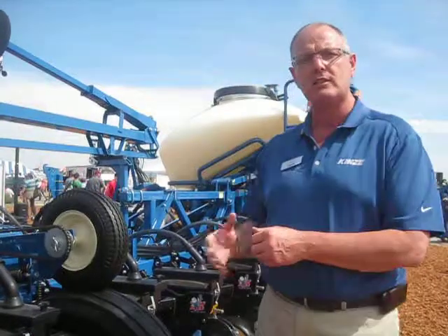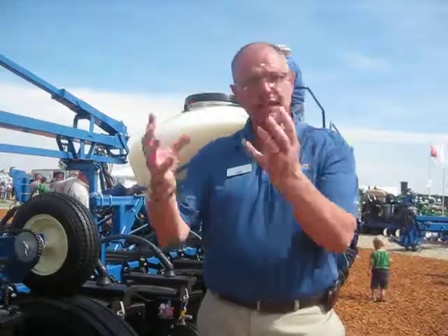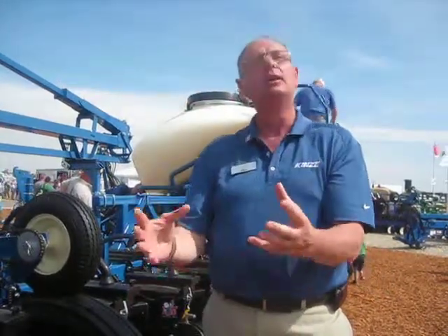What it does is, as you can imagine, you have these bulk tanks that you see behind me that will contain a total of, in this case, 80 bushels of corn. And that tends to concentrate a lot of weight right down the middle, which if you're a no-tiller, you get a lot of compaction, which you don't really want to have.